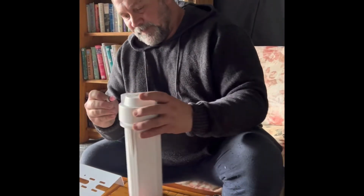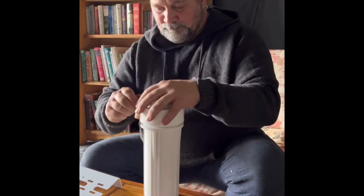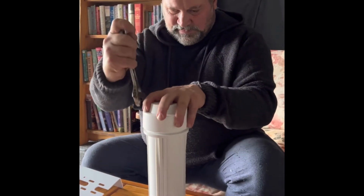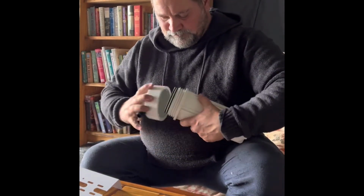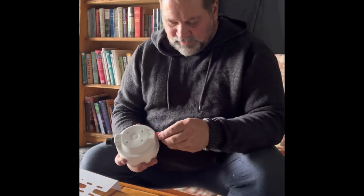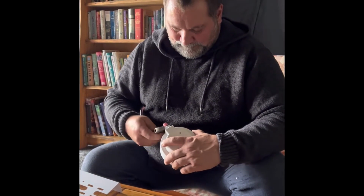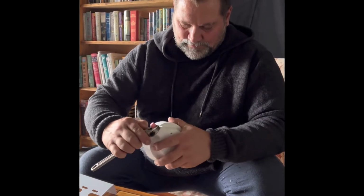So what I'll do is, this can be our inlet from the tank, so I'm going to put the big connector on. Just make sure we get in there. Make sure that's nice and tight. Okay. So that's the inlet. So that's the first filter. That will be the polyspun filter. So then we go out from the polyspun. Just give that a little tighten up with this shifter.